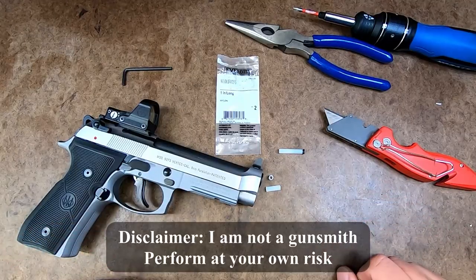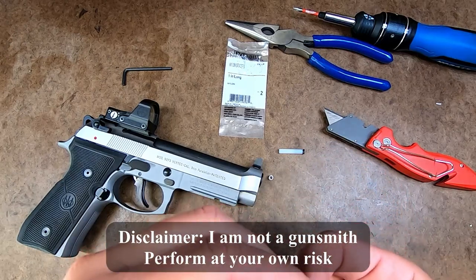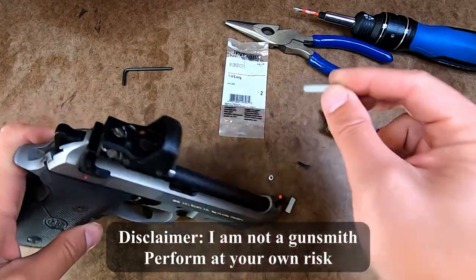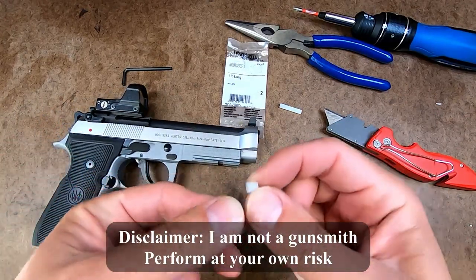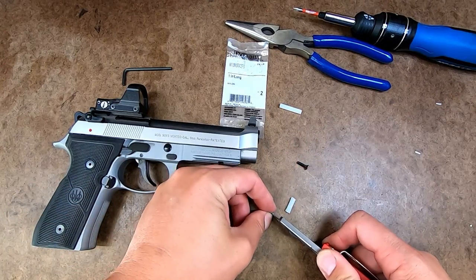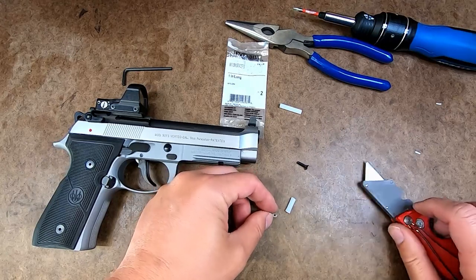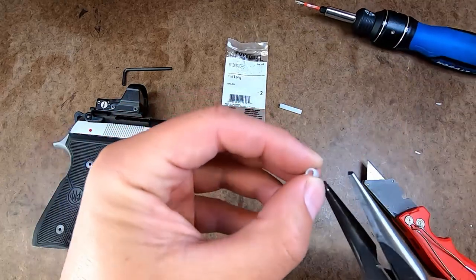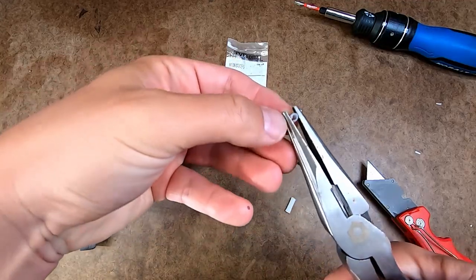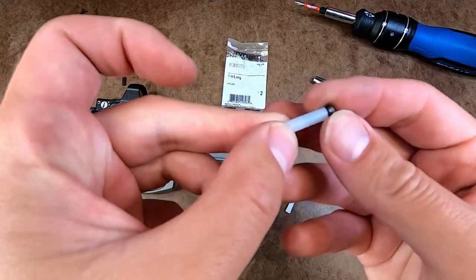It's all in the back. So I went to Home Depot and I got some nylon spacers, and I got something that was close to fitting, but it wasn't exactly the right size — it was a little too large. You can actually see that there; it does not fit into the counterbore hole. So what I did was I chopped it down to size. I already have one in there, so it's been tested. I took a razor and cut off a little bit like so to allow the spacer to compress. Then I took my pliers and squeezed it together so it's like a circle again. You can see that the screw does fit in there, though it does have a little bit of play still.